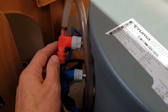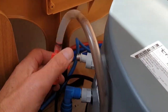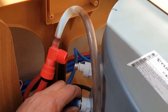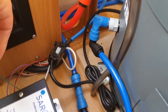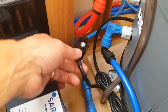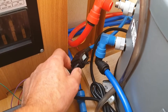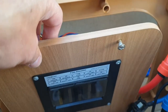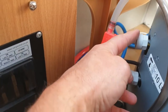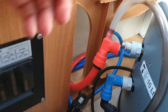These hot and cold feeds - I've done these for speed - but literally just unscrew them like that and they pull off. Simple, really. It's only held on with a rubber bung and a push fit. You'll also have to disconnect the power feed. In this particular van I've had to undo these four screws down here, which basically gives me a bit more space to play. Because of that, there is your element.